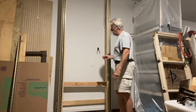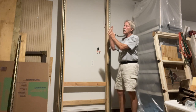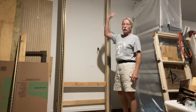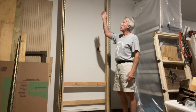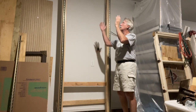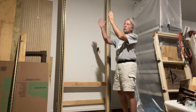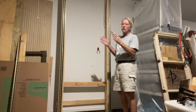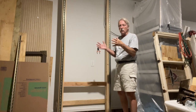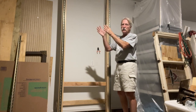The way you do this is start by picking your location. I was very lucky that the location I picked is the tallest part of my attic. There was also about a 28-inch wide space between my ceiling joists, so I didn't have to cut any out. Normally you'll find spaces are 15 to 22 and a half inches wide between ceiling joists, which isn't wide enough.